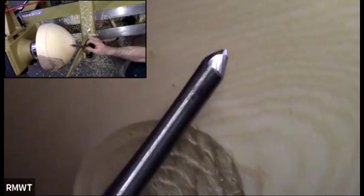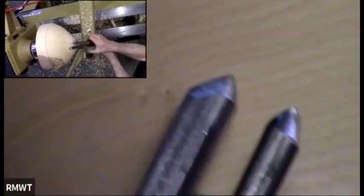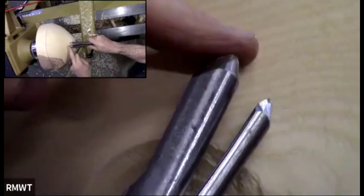Then look at the spindle gouge. So this is a spindle gouge. If you're doing detail, fine detail, it's got a 40 degree bevel, round tip nose. They look the same from the back. But from the front, you can see that this one has a deep wing. Oops, I can't hold it still. Stay still. This one is the deep wing for the peel.